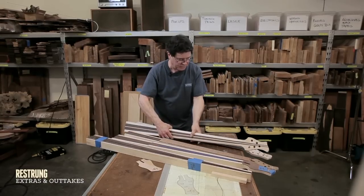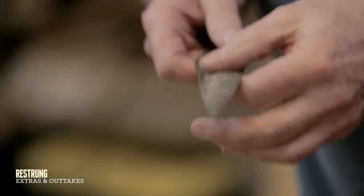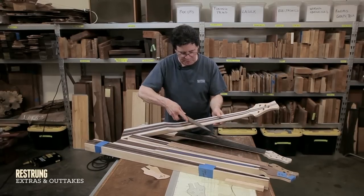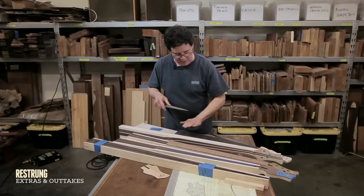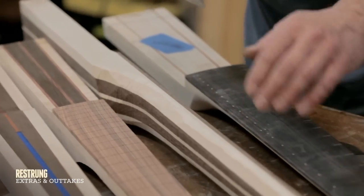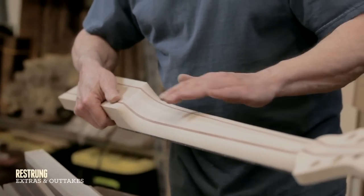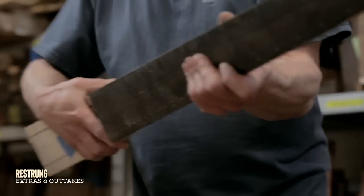The magic is that I go to files and rasps at this point. These particular rasps were made in Japan — they're handmade and all the rows are random, not machine channels. They're the most wonderful rasps to use. What a file basically does as you're using it is take off the high and low points — it averages everything out. So I go through lots of rounding, lots of feeling; it's a touch thing. With a lot of rasp work and then finer and finer sanding, I get to where the contour is rounded and feels exactly like it should.